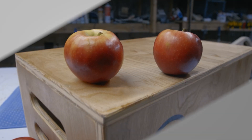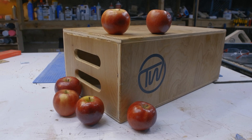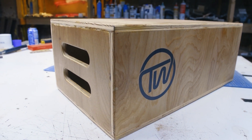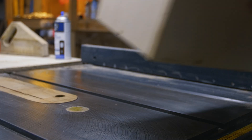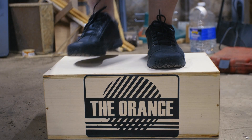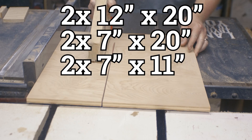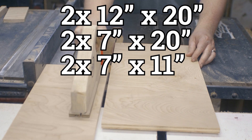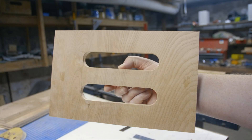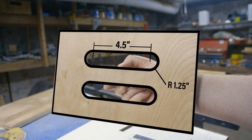On the Cool Tools channel, I've got a new video about how to build Apple boxes. Apple boxes are sturdy enclosed boxes from the world of filmmaking, usually used to give actors a height boost, but they're also great pieces of shop furniture — you can use them as a tool stand, a seat, or just to reach the top of a tall shelf. I know plywood is still pretty expensive, but you can make a full-sized apple box from a 2x4 sheet of half-inch plywood. Linked in the video is the full cut list and plans for the build.